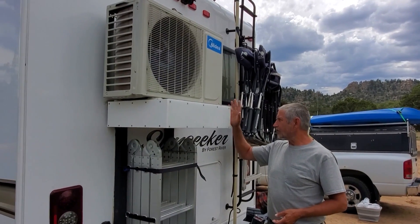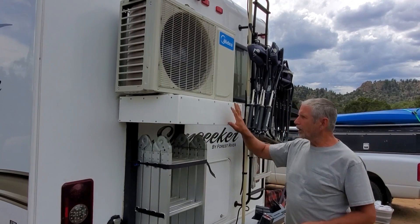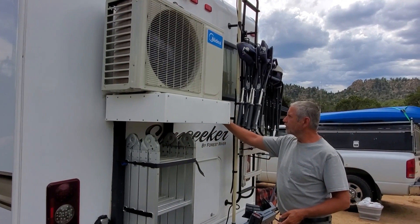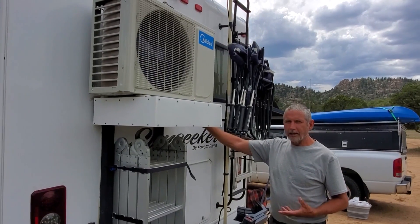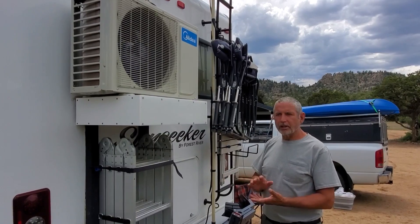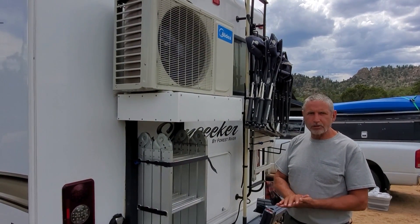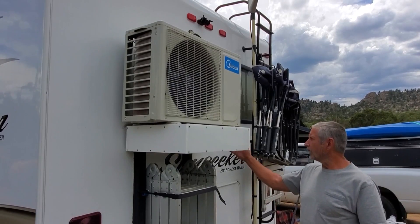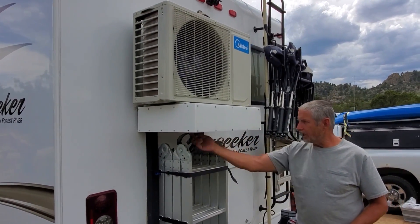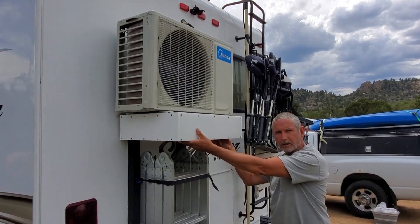As far as the installation goes, after I mounted this with just four bolts, I put a shroud — a box made of UHMW — around it. The copper lines are 15 feet long and you cannot shorten them; the copper lines are used as a reservoir for the extra Freon. The excess copper lines I coiled up underneath and then built a box around the coil of copper lines.